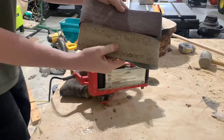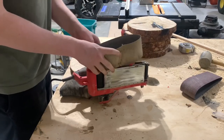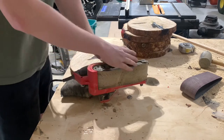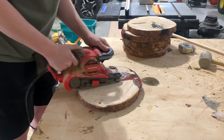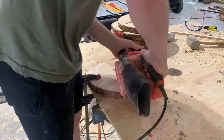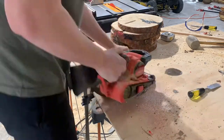Time to get the belt sander out. You can see the bottom piece of sandpaper I've used for resin in the past and how it kind of ruins it compared to the one just used for wood, so I'm using that one to save the other. After sanding for about five minutes it doesn't take long to realize this is going to take forever, so eventually I switch back over to the router sled and end up shaving just a little bit off each side again.